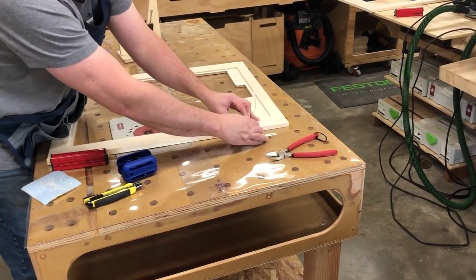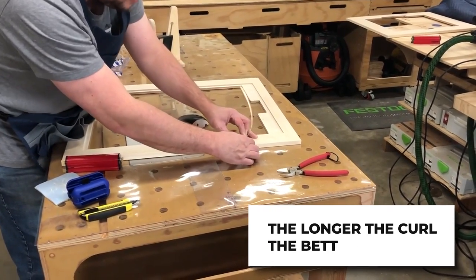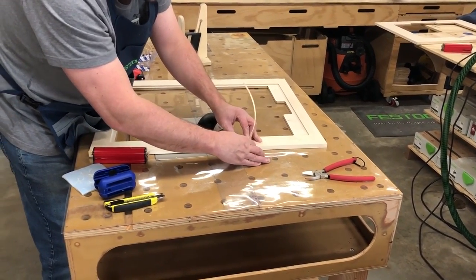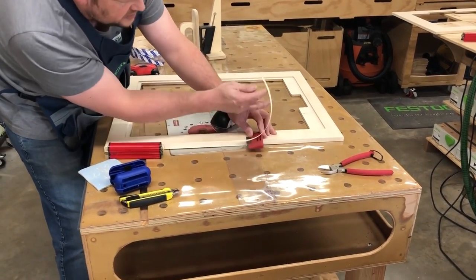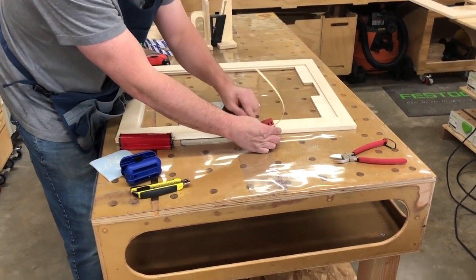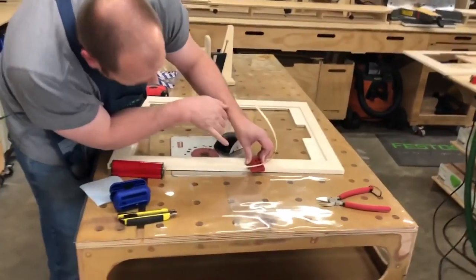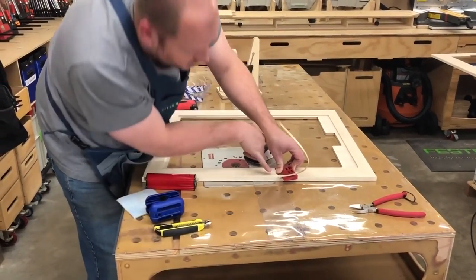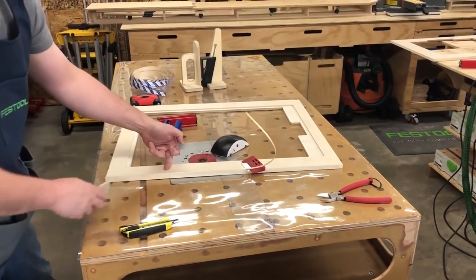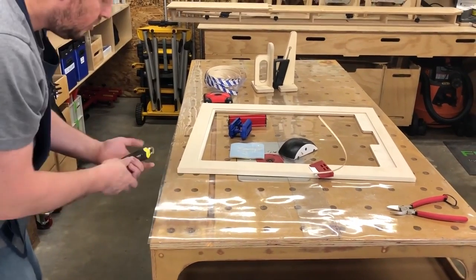What you want when doing natural edge banding — just like when you're using a plane or shaving wood — is you want to get this to curl. The longer the curl the better in my opinion. As I'm pulling I'm just putting pressure in and letting it curl up on itself. If you notice resistance, a couple things: you might have too much adhesive building up on the blade, your blade might not be sharp enough, or you could be fighting the grain.